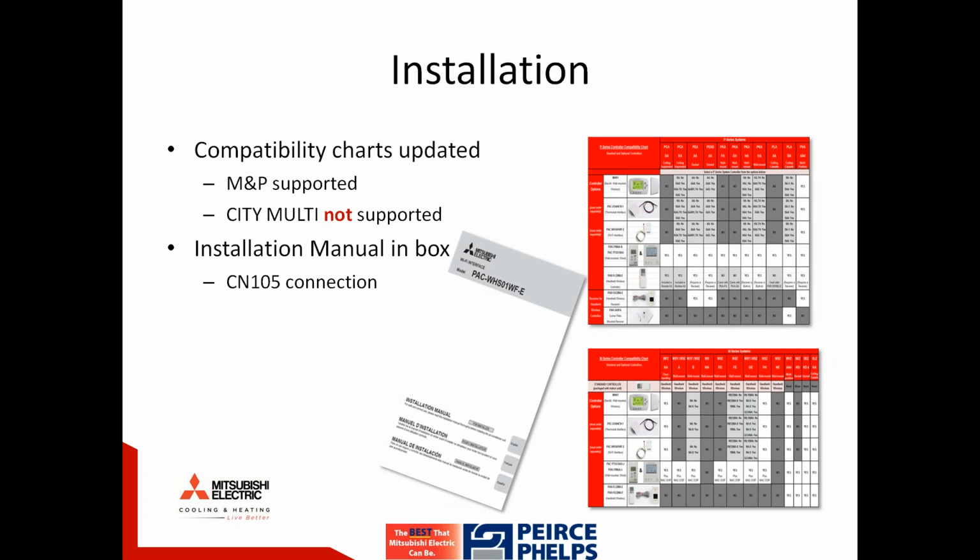The other thing I'd like to point out, on that video, Charles was pointing out the importance of understanding which lights may be illuminated. I'll point out that those lights are not on the front, but instead on the back of the device, making it important that you have the ability to view the back of the device during that process. So I wouldn't stick it on something with double stick tape, because you won't be able to get it back off and view the lights. A mechanical fastener and/or something like Velcro may be more appropriate.